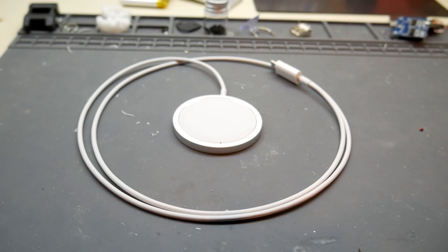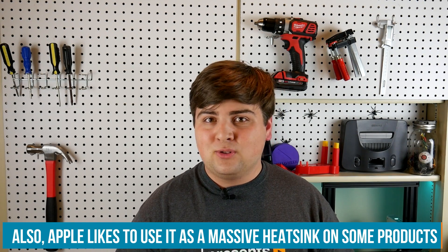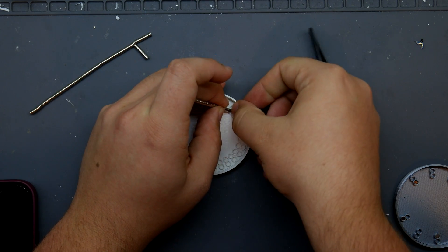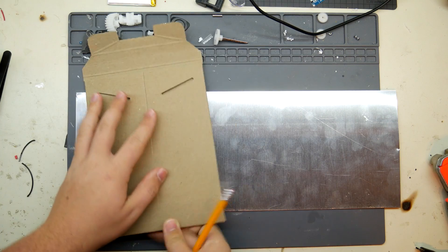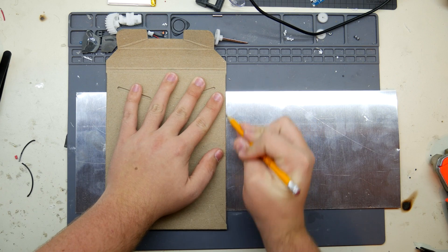The next aspect I was really looking forward to was incorporating aluminum into the design. Apple has a long history of using aluminum in their products — from old iPhones, to MacBooks, to the current MagSafe charger. Apple has shown that aluminum can look sleek and even futuristic. I decided to keep a plastic mount where the magnets are housed, since making that out of aluminum would require welding or something I just don't know how to do. But I decided to make the walls out of aluminum — that fixes the thick PLA wall issue, and since aluminum is stronger and thinner, I have more room to house all the electronics and the battery.